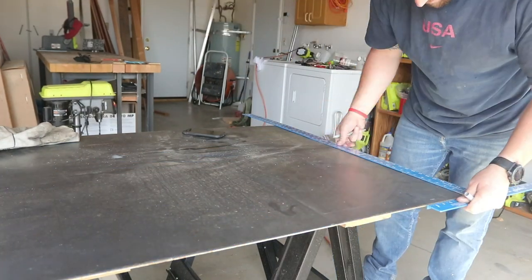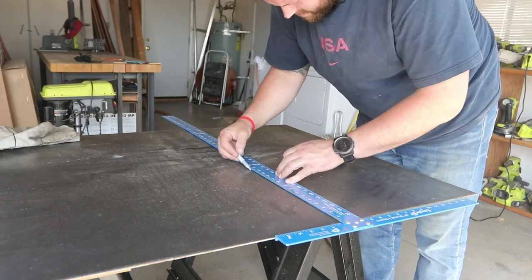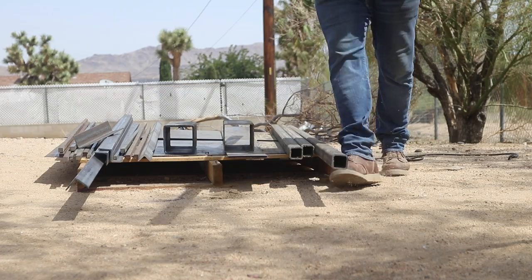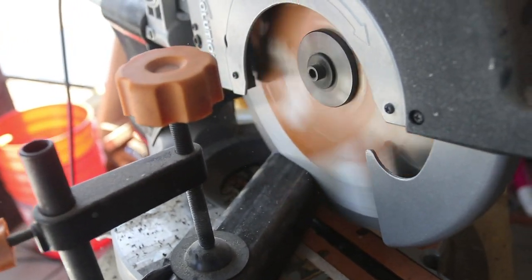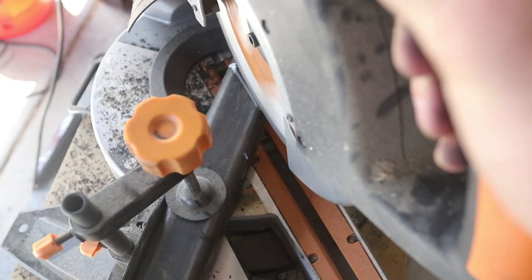Here I'm laying out the shape I want for the chair sides. Because of the thickness of the ruler I'm using — it's two inches — I can just trace around it with a silver Sharpie. I quickly cut the first 45-degree angle with the handheld angle grinder and then move over to the chop saw for more speed and efficiency.